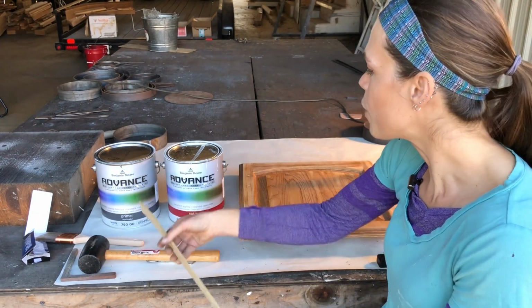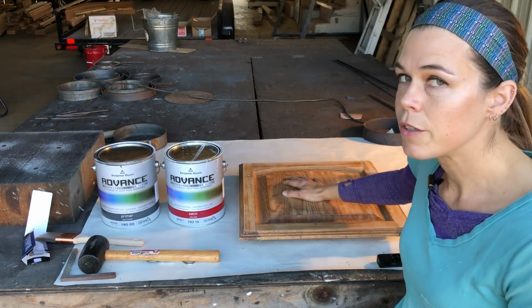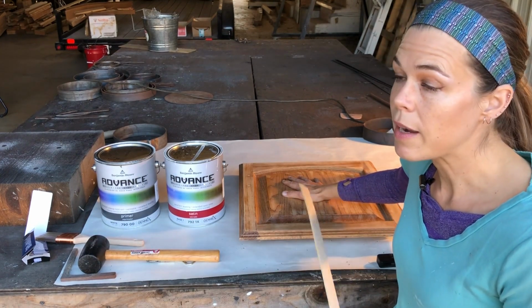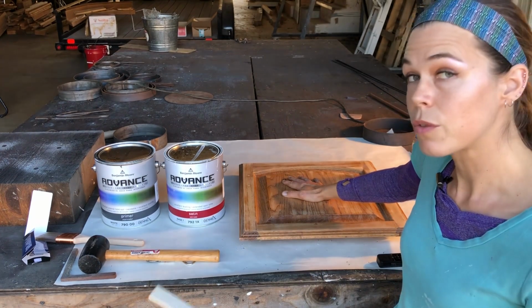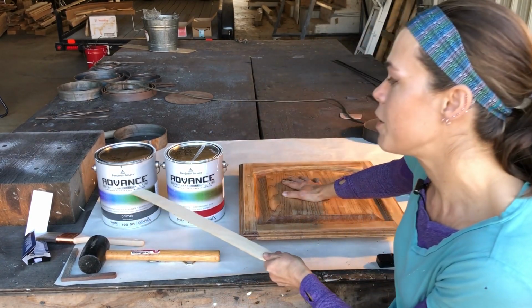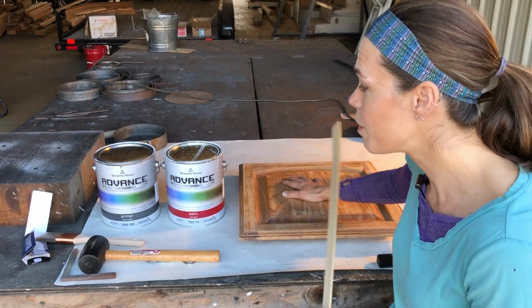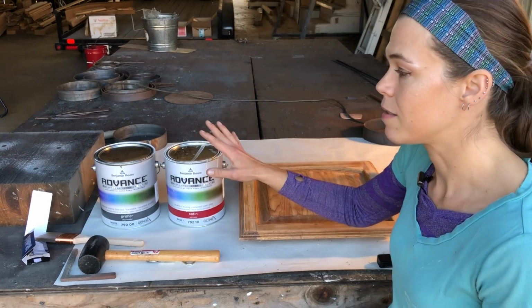They made a water-based paint and primer that can cover polyurethane and oil-based stuff. So normally you have to have something really fumey and nasty in order to cover what this door is finished with, and if you get the Benjamin Moore Advanced Waterborne Interior Alkyd line, you do not. So there's no bad fumes, and the final finish on this is beautiful.